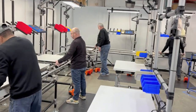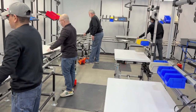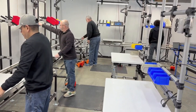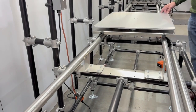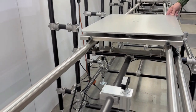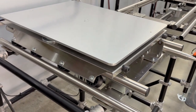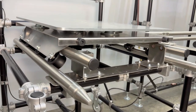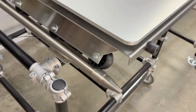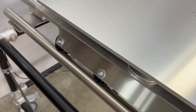Work Smart worked on the cart and track tube design for low-effort worker-paced flow through the build process, utilizing our Fleximate integrated station design. A custom 24-inch track width of stainless steel construction was designed for the product's large 24-inch by 30-inch footprint and heavier weights, for high reliability and frictionless flow.